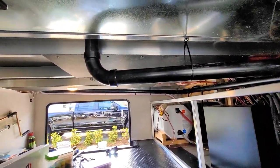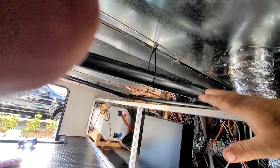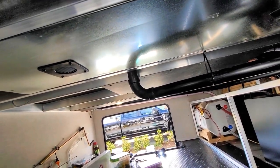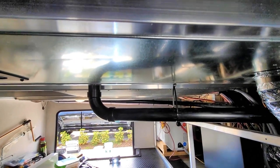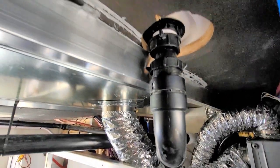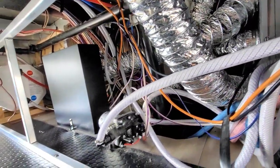The plumbing here — if I put a smaller elbow and re-plumb it, I can move this black pipe up closer to the heated area. This hose is just to heat this bay — that's all it does — and the heat comes out this vent. It does heat the floor upstairs to the shower to some extent. But it hangs down about five inches, and I don't want to slide a tote in and bust it off. There's room for it to be taller, so that's what I'm going to do. This is also the shower drain right here.